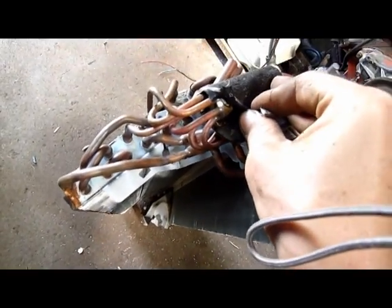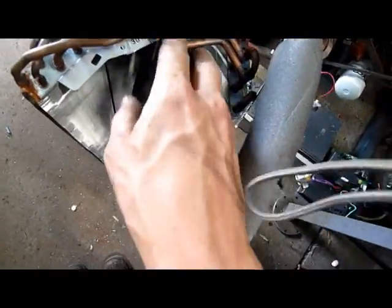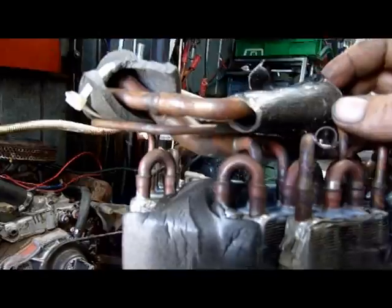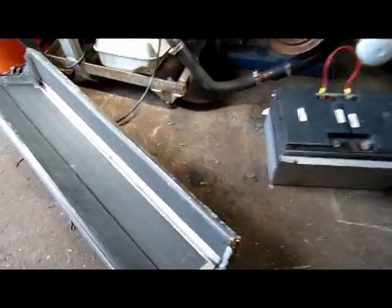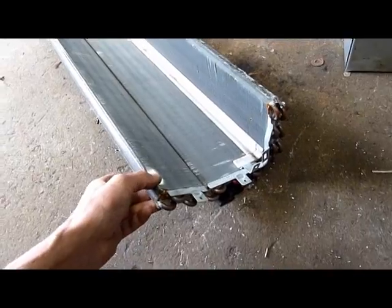The rest of this is the coil unit. That is a liquid splitter — it splits out from the liquid line, which is actually already post-expansion from the expansion points in the outdoor unit as I mentioned earlier. It splits the refrigerant into various passages in these coils and it comes back out in a common manifold below it. That's the suction line manifold coming out of the coils and that's the liquid line going in. Part of commissioning one of these units is to pull an absolute vacuum down to micron level to remove all air and moisture, in conjunction with using dry nitrogen to help absorb moisture.